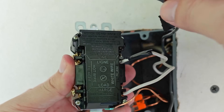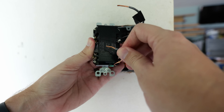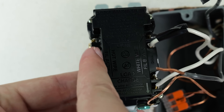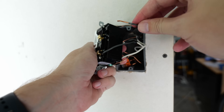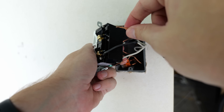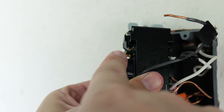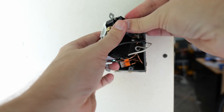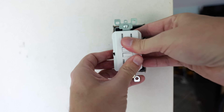Now all that's left are my two black wires. First I'm going to do my load wire, which does not have the flag on it — I'll connect it down here where it says 'load' on the side where it says 'hot wire,' sliding it under the plate and tightening it down. Last but not least I'll take my last black wire — this one has the flag on it for our line, and this is the one actually bringing the power in. I'll connect it up here where it says 'line' and 'hot wire,' slide it up under that plate, and tighten it down. All of the wiring is now connected to the new GFCI.